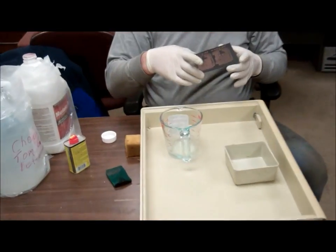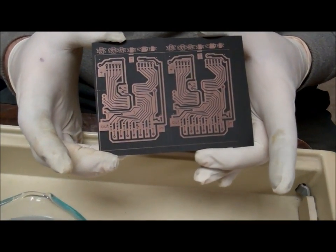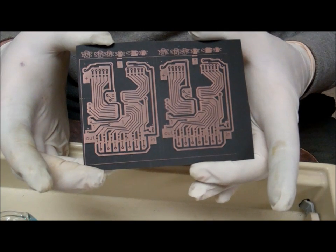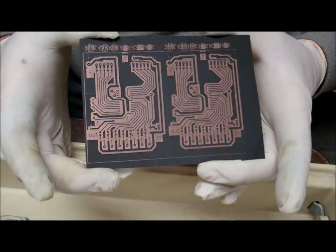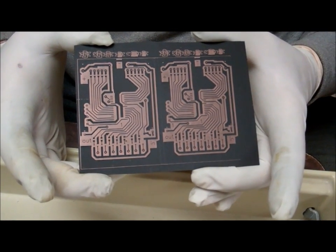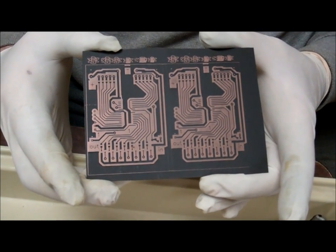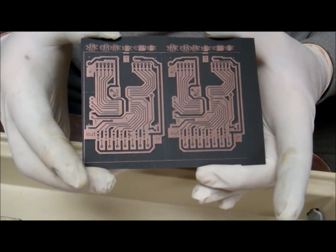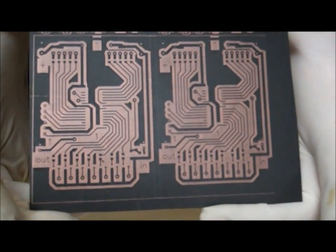What I've got here is a circuit board that I designed in DipTrace. I took a bare piece of copper clad board and painted it with flat black spray paint. I then put it in our laser cutter at 50% power and 100% speed and etched the image twice, and that burned off the paint. If you took a little alcohol and a paper towel you could clean it up and see the bare copper, but the process I'm doing now doesn't need that.